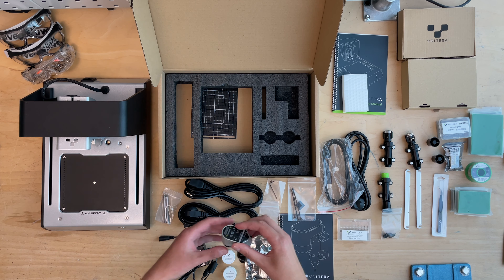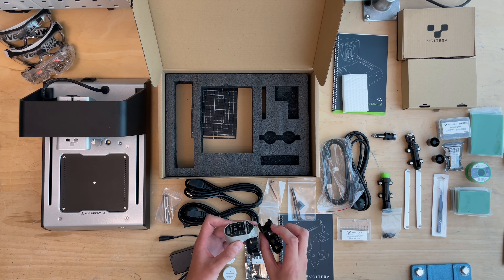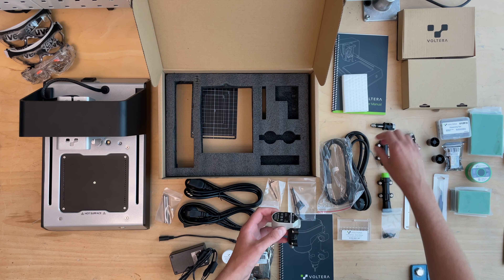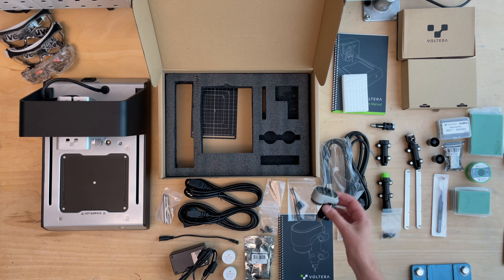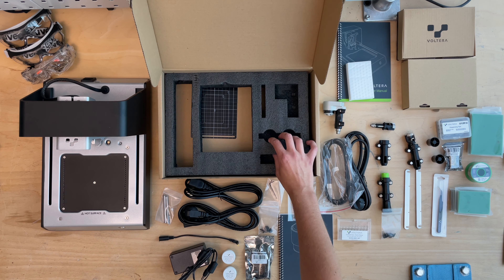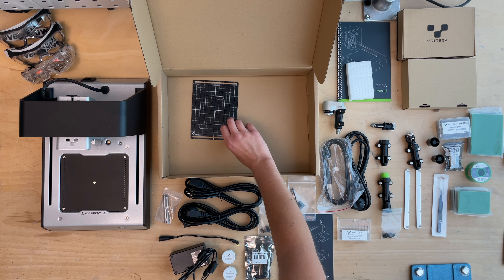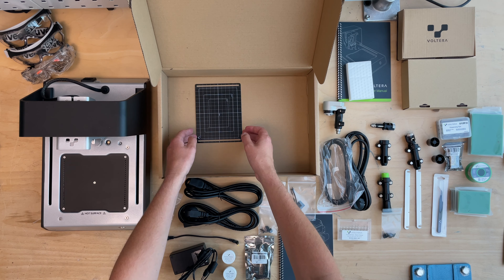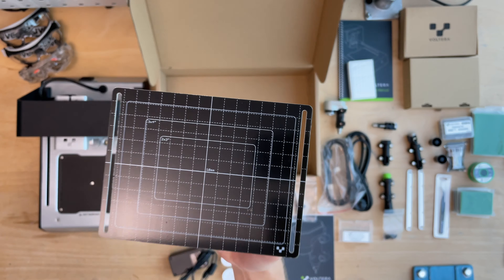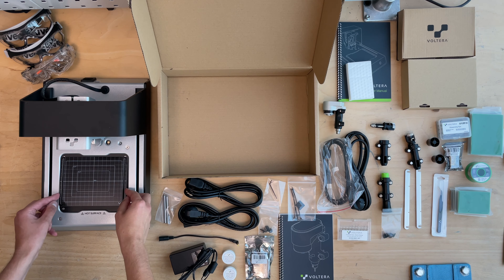There are also cable ties to fix the extra wire, which is a bit awkward to handle as you'll see in following videos. These wires are for connecting the top and bottom layers of the PCB with copper vias that you insert manually. We get a bunch of drill bits as default, and a tool you use to hammer in those copper tubes to create the connection between top and bottom layers.